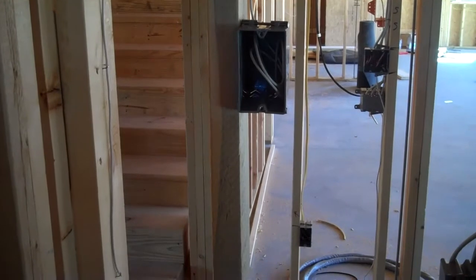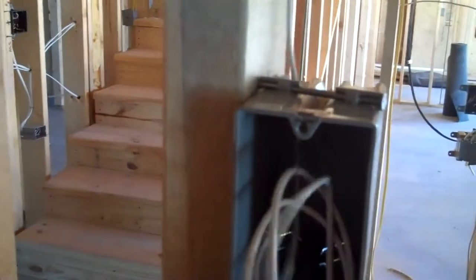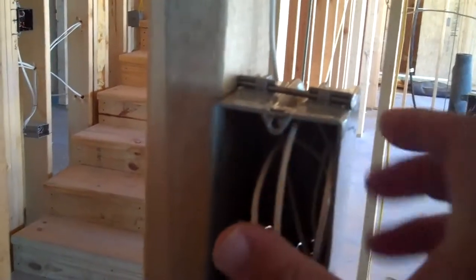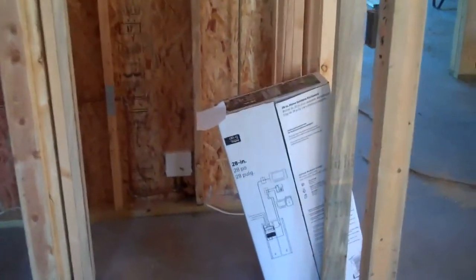In this video we're going to show you how to pre-wire a burglar alarm keypad. You're looking at a single gang box, and it's got a 22-gauge 4-conductor burglar alarm wire in it. This is going to be a keypad location, right next to a light switch so that you can turn it on when it's dark and see the keypad. It's in a little hallway adjacent to the foyer.